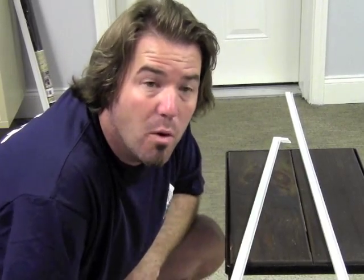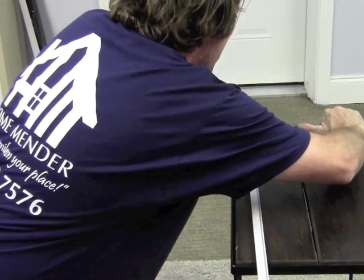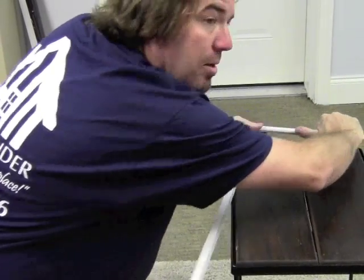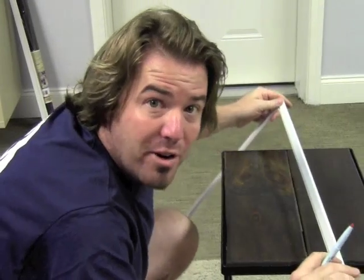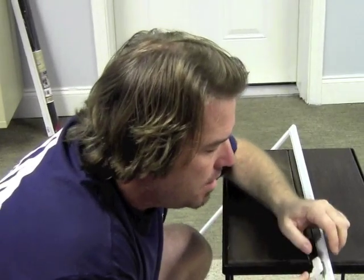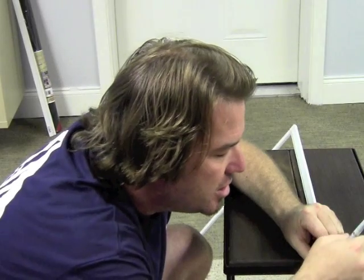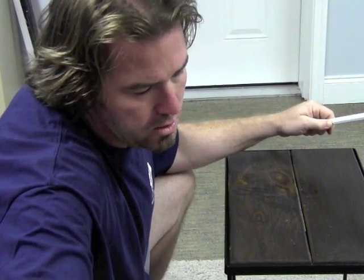Fit your corner — 28 inches long with the corners. Next, we want our other side to be 24. Take what's left over from our screen track, put the corner in there and repeat the steps for the 24-inch side — we want it to be exactly 24. Mark your 24, then lay the corner up on it to get an accurate mark. The mark should be at the outside edge just like the first time, and cut the track. Now let's check our measurements with the corners on — we got 24 by 28, right on the money.